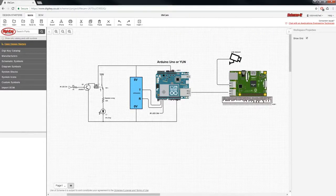This reduction in distance will be picked up by the Arduino Uno, which will then send a serial message to the Raspberry Pi. At the same time, the Arduino Uno will also trigger the relay to turn on for five seconds. Turning on this relay will enable power to the infrared LED array, which will help give us a bit of night vision so we can see the animal if we're taking a picture at night.